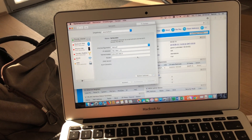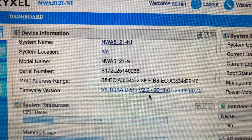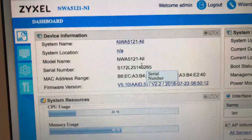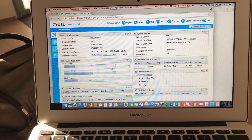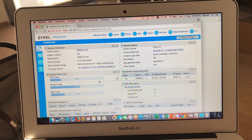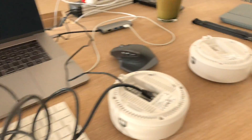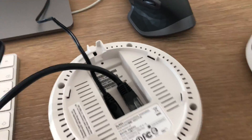This one, the 64, is directly attached to my Mac, and surprise — it's reporting as 65. So when you try to have both in a network you get some problems, but if you're using an NXC 2500 controller like I did, you get big trouble — it just keeps crashing every time you add the access points.